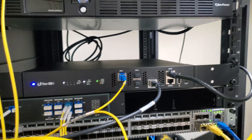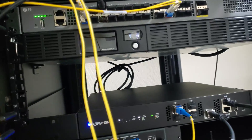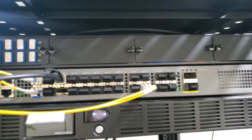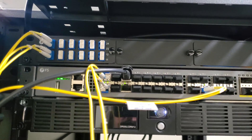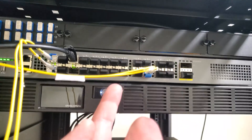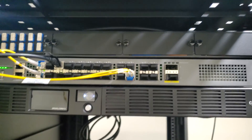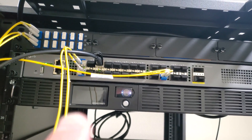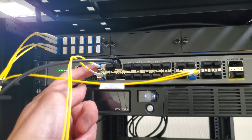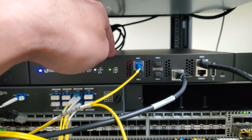I've removed our old management network. This is our old FS switch — we bought it brand new a year ago, but I'm taking it out of service, updating it, and putting it back somewhere else. This is our current link: a 5-gig connection over a 10-gig optic. I've got two 10-gig optic customers, some 1-gig customers, and a DAC cable that feeds our OLT.